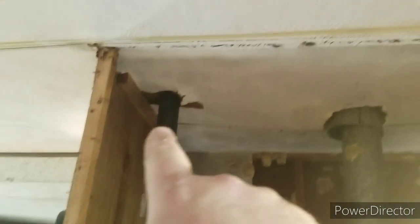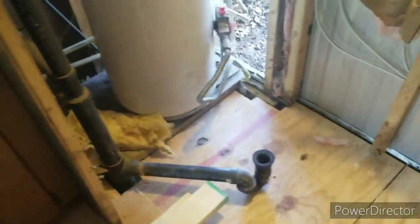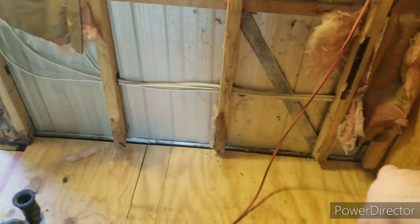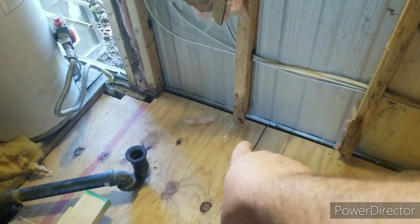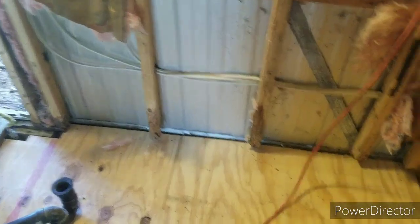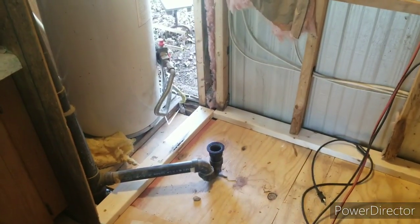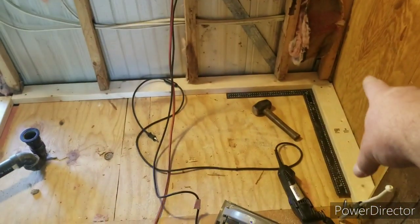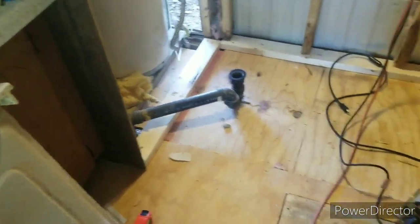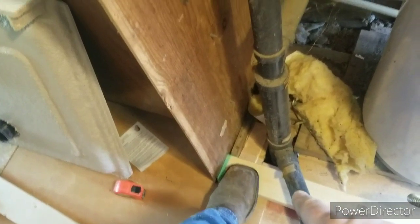What I plan on doing right here is I'm going to take this little piece of wood out and frame up this whole opening with two-by-fours, just make it nice and solid. Then I'm going to run a two-by-four frame along the bottom here, cut these wall studs out to get the rod off, and figure out how I'm going to piece that together. I've roughed in some two-by-fours on the boundaries and I'm going to run another two-by-four from here up to the ceiling.